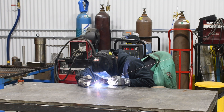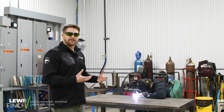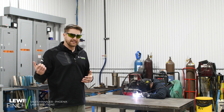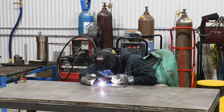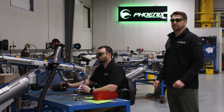As you can see, there's just a lot more heat input with conventional TIG welding. Because of that, distortion and warpage become more of a concern than with pulsed laser welding — that's always something to consider, and it's one of the biggest differentiators between the conventional process and laser welding.